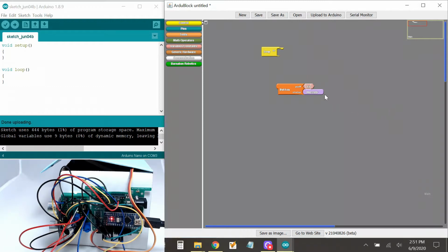Now there's two things here. It's pressed or unpressed. Pressed means low and unpressed means high. So let's just keep it on pressed. Okay, so if you remember from when we wired up the switch, we connected pin A, or one of the outside pins of the switch, to GND. So that means that when we slide the switch, sometimes pin 11 will become GND, which is the same as low. So that's why we're going to keep it on pressed here, because pressed means low.